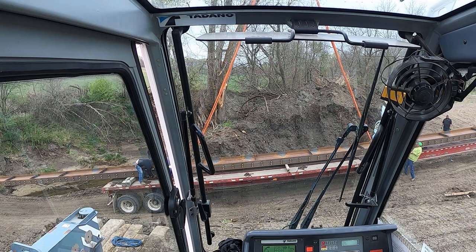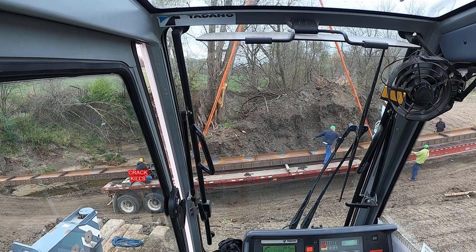Looks like they flipped the shackles over. They were having trouble earlier with the shackle binding up on one of the beams, so they flipped them over. They should be fine. And they've got pieces of 3.5-inch steel pipe with slits cut in the side that they're sliding over the edges of the beam so the beam doesn't cut into the steel choker. So using those as softeners.